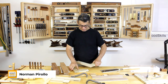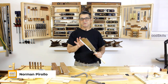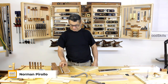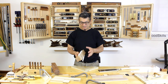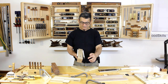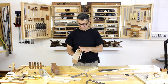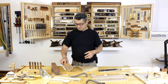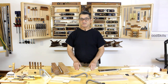And I've got various examples, but the hand tools I'll be using are a Japanese Ryoba because of its thin blade and thin kerf, and this allows me to attain considerable precision in the cut, along with a miter jack saw that I've developed. It originates from a French design of the mid to late 1800s, and this is our modern version with a pivoting blade and both a crosscut configuration and a rip configuration, and this pivots. You can flip the blade over also for left to right hand orientation. I've described this considerably in my most recent three or four videos, about the miter jack saw and the Ryoba saw to create very precise and accurate joinery.